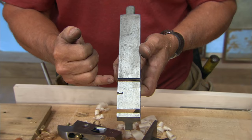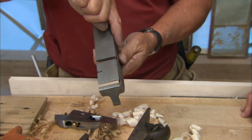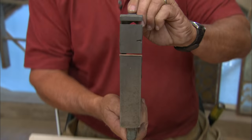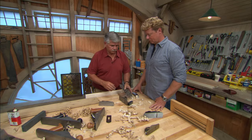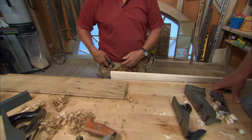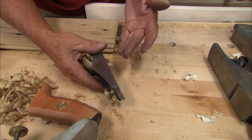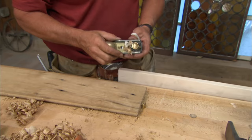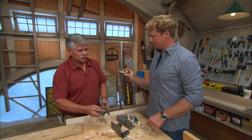Here's another one — this is also a plane where the blade comes all the way out: a shouldering plane, also known as a rabbeting plane. It goes tight against the joint of a casing or a jamb when you want to true it up nice. You can actually move this blade forward to get right down to the bottom of the jamb or up to the top at the head — less chisel work. Now this right here is probably the plane I use most of the time. I keep it in my pouch. I use it for truing up just about any edge — sidewall shingles, chamfering or flattening an edge or surface. It literally fits in your hand like a sanding block — they call them block planes. It's a one-handed tool.